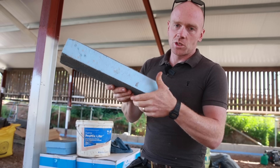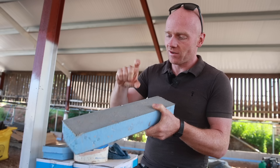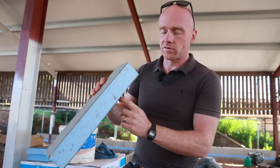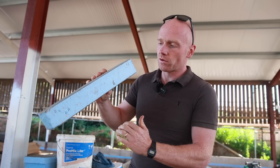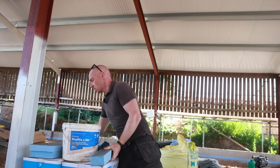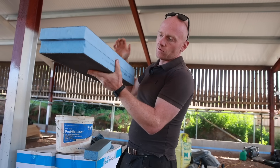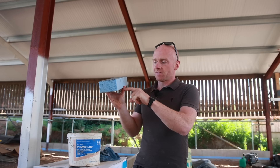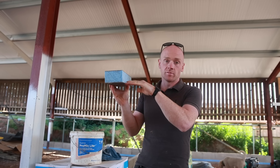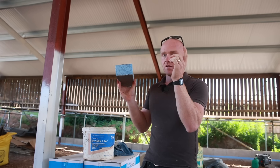You might think that's surely not strong enough to build on top of, but this is actually a 9 Newton block. The reason it is strong enough is that inside there are tiny little concrete columns — resin concrete columns — which go from the top down to the bottom and transfer all of that weight down onto the structural blocks below. You can get them in a conventional brick size, which is what we've been using, and also a 200×500 width. This one is 100mm thick. It doesn't really matter if our insulation is the same thickness or double or triple this, as long as it's continuous — the bottom of the insulation is level with the bottom of the Thermoblock, giving us that continuous layer going through the wall.